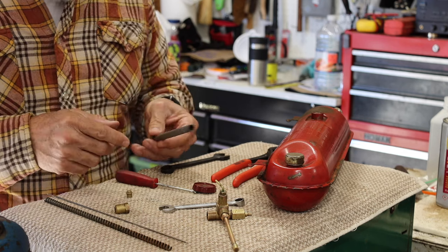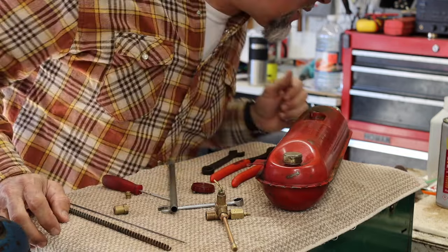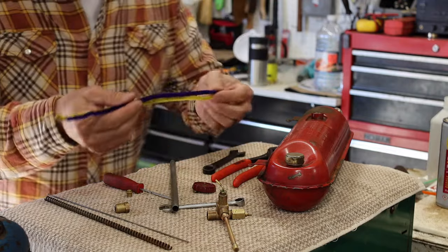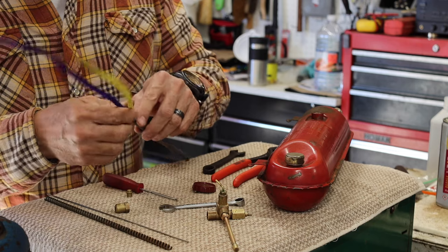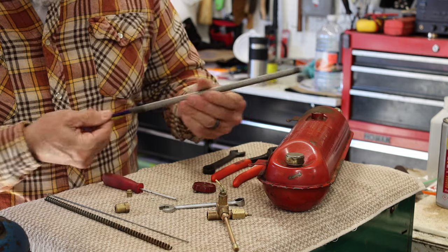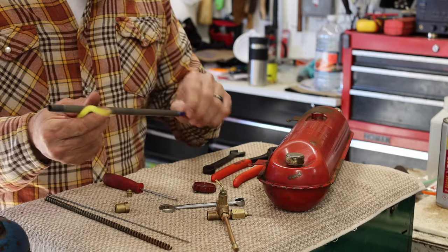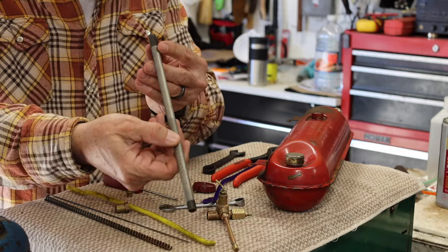This goes in first just like that. This was nasty inside, so what I did is again soaked it in distilled water. Then I raided the kids' craft closet and got these pipe cleaners. I twisted one end up and shoved them through there - it was tough because there was so much buildup, crud, rust, and scaly stuff. I ran them through there a whole bunch, twisted it, and it came out finally. I looked through it and blew through it - it's all nice and clean now, ready to be assembled.